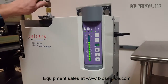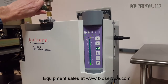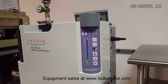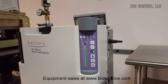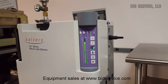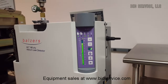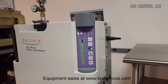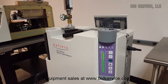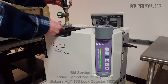I'll go ahead and open and close our external leak. As you can see we're at the 8×10⁻⁸ range. When we're done we'll just hit the Vent button — that'll vent port 1 for you — and then go ahead and take off your component when it comes to atmosphere.